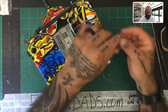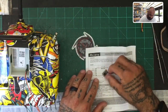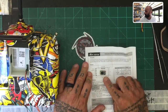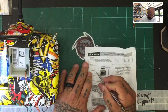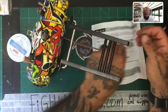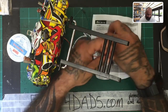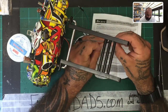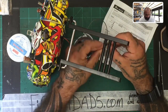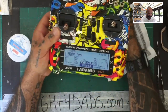Assuming this is right, you'll notice your pins here — if you're holding the radio the same way you'll see positive, ground, and signal. Let's go ahead and hook that in accordingly. I'm going to stand this up so it's not pushing on any switches. We're going to take positive as the second from the bottom and plug that in, then ground in the center, then alternate again and put our S-port on the second from the top. There we go.